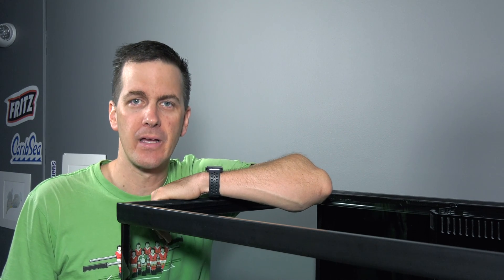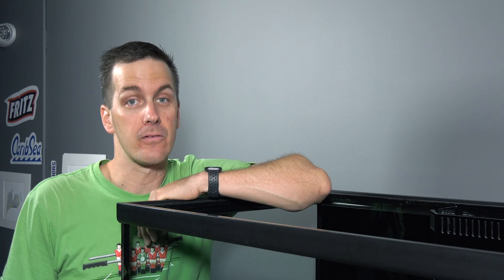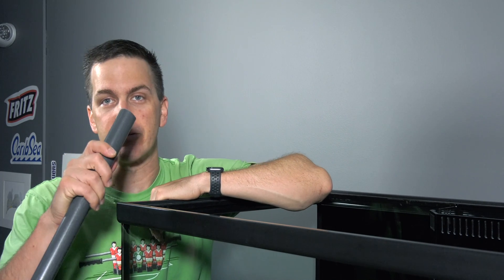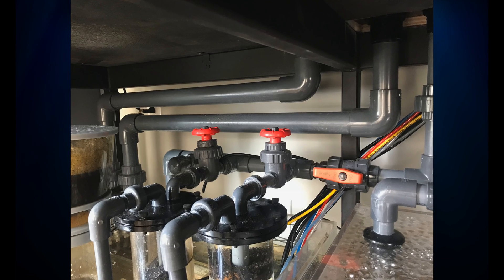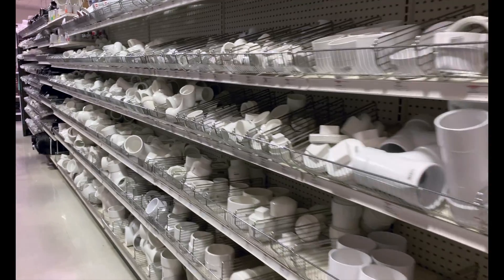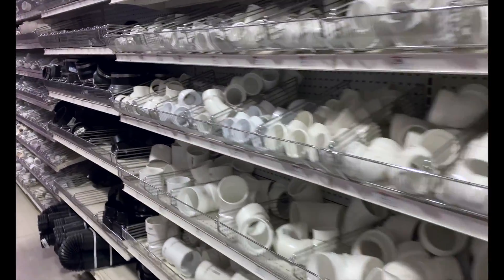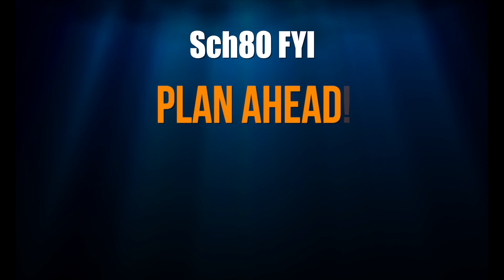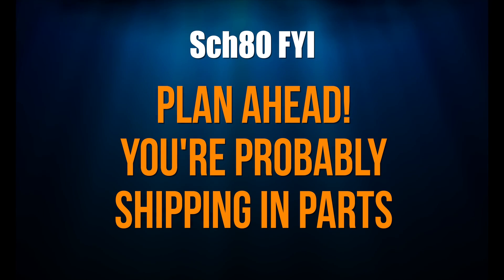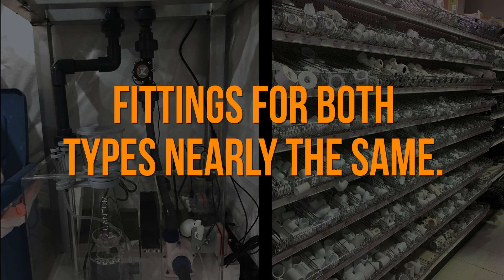So what type of pipe should you use? Personally, I don't recommend 200 psi pipe as I find it harder to work with. Schedule 40 pipe can work fine, and personally I prefer the look of schedule 80 pipe — I like the industrial look, even if it is overkill for your saltwater tank. Schedule 80 does cost more and the fittings can be harder to find. With schedule 40 pipe and fittings, you can walk into any home improvement store and find a good selection. A lot of plumbing supply stores don't even stock schedule 80, so if you're going the schedule 80 route, you'll need to plan far enough ahead as you'll likely have to order in parts for your build. No matter if you use schedule 40 or schedule 80 pipe, you'll need fittings to make connections, and the fitting selection between the two types of pipes is nearly identical.